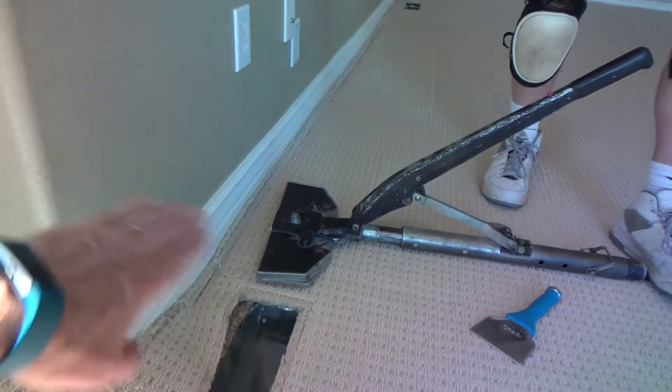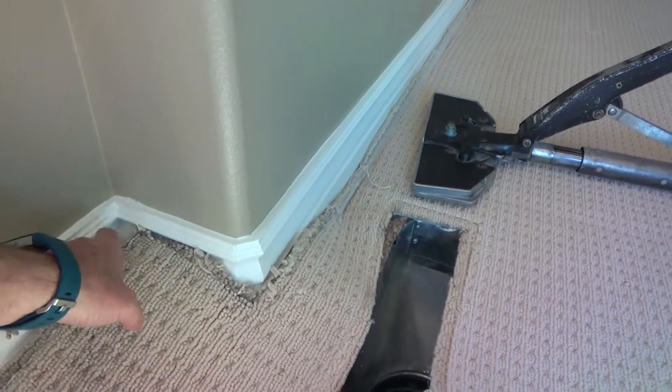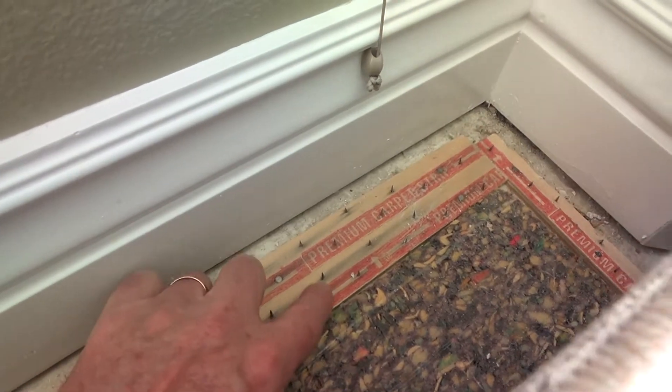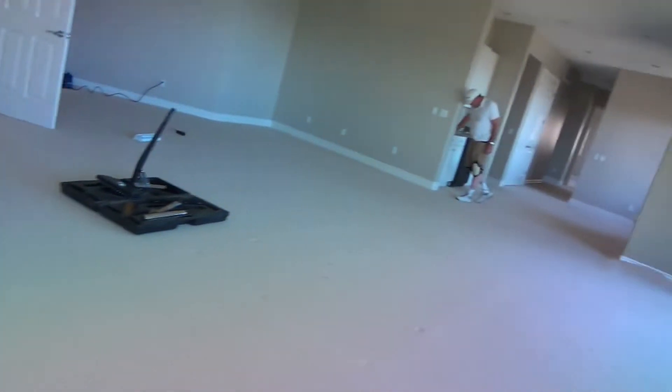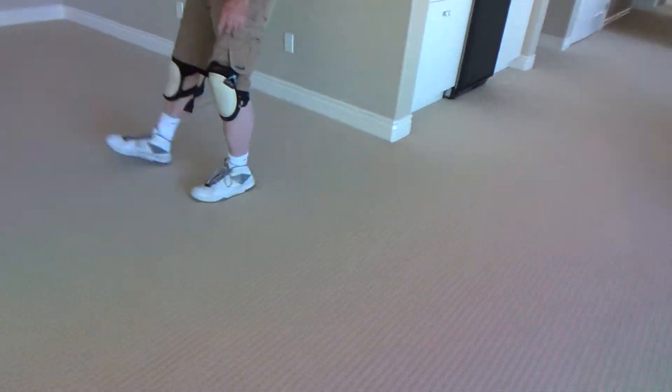That sucks right up, and those little nails is all that holds this carpet stretched. See how they used two rows of tack strip here — they nailed it down and all these are little nails coming up, all the way to here. Wow, that's pretty good. I sure thought you were going to have to use that other stretcher. You can tell how tight I got this carpet.